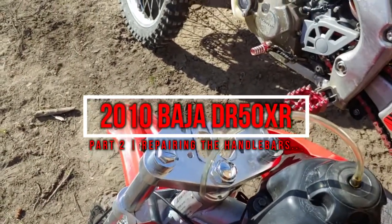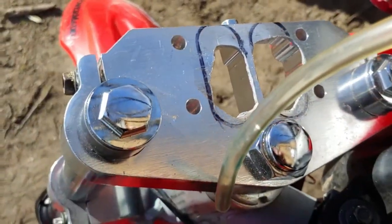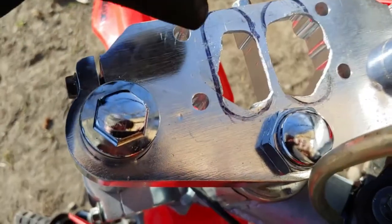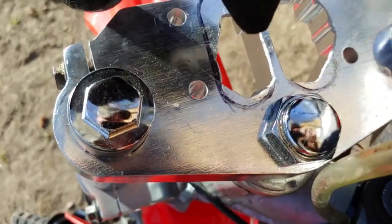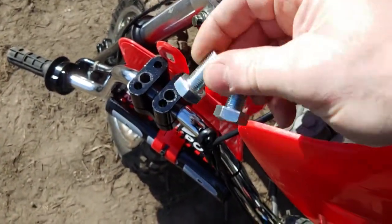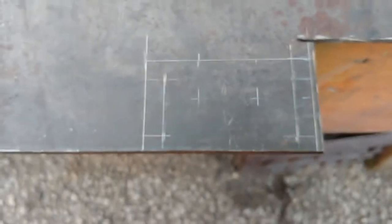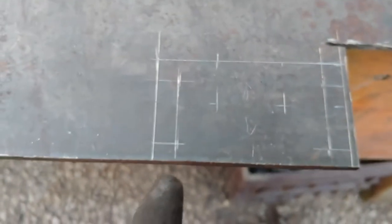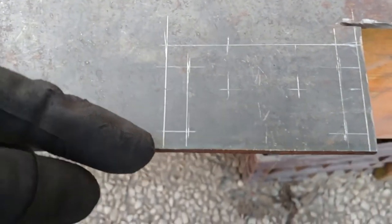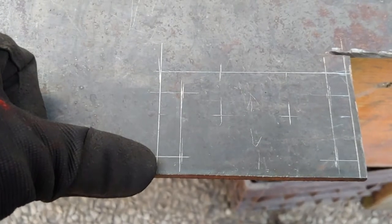Last fall I experienced a problem. What I'm doing currently is making a plate that spans this — it's going to be four inches by two and a quarter. I'm going to drill four holes in it and two in the center to fit the two mounting bolts. We've got our plate measured out: four inches across, two and a quarter inches from top to bottom, with four holes that are three and three thirty-seconds apart.